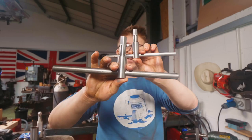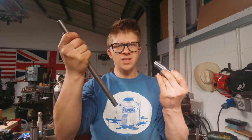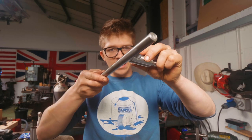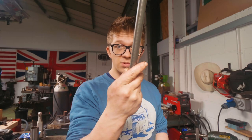With those holes done, the handles now fit on both these wrenches — super exciting. But naturally they don't stay on. We're going to solve that with one of these: a little pin that we'll hammer in there. This pin is going to go all the way through and stop it from coming out, but obviously it needs to go through the handle too — smack bang in the middle from side to side.